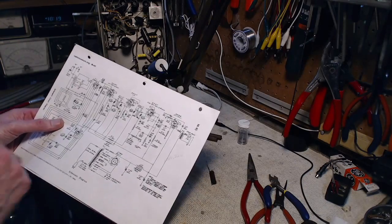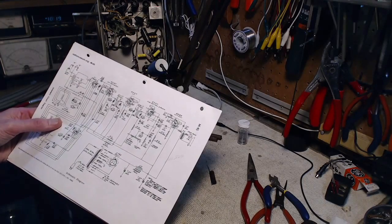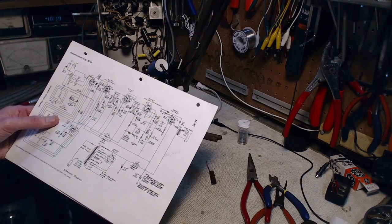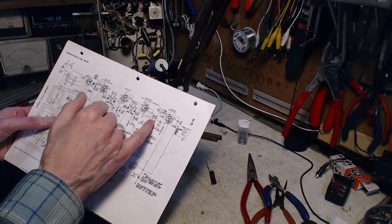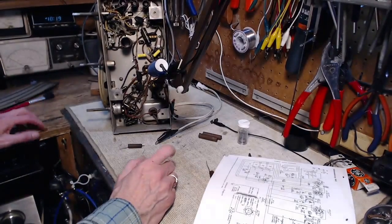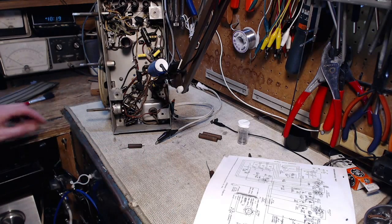Wow, I'm surprised. Yeah, there's the phono socket and the tone switch. Maybe when you plugged in your record player, the tone was crappy. Throw the switch to compensate. But it is a 0.0025. Well, that's interesting. Not what I thought it was at all. 0.0025. Could put a 0.002 or a 0.003 in there.